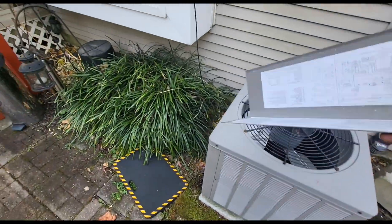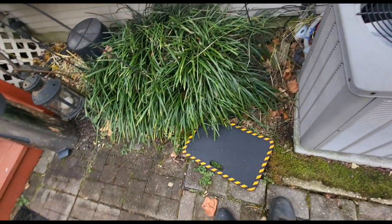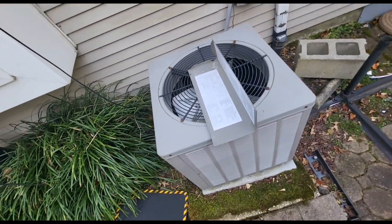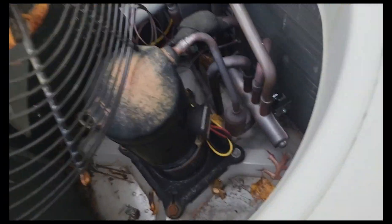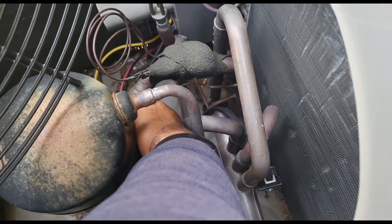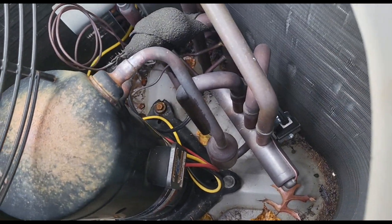Let me look at the schematic. I'll take my disconnect out and look at the reversing valve. I'm going to have to pop the top — I want to trace this back from the valve all the way back to the board. Wait — I can hear my contactor energizing and de-energizing just from me touching the reversing valve wires.